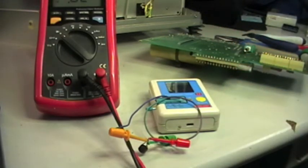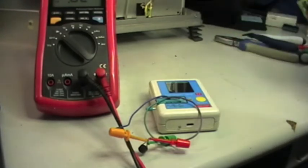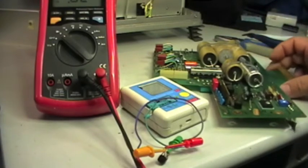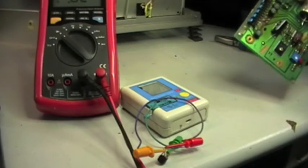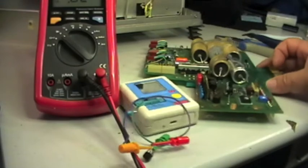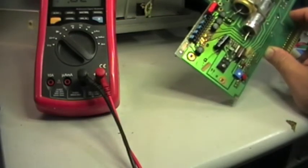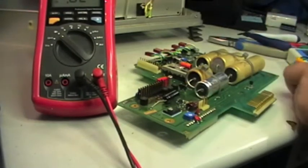Well, at this stage I wonder why, if it has been a short circuit that has been repaired in the past, since I was seeing this burned trace, or if the problem are the capacitors. Well, this is very strange. Two bridge rectifiers faulty in the same board, it's a rare condition. So I wonder if for troubleshooting somebody has made some short circuit or some unexpected contact on the board and damaged the bridge rectifiers, because the capacitors are not really bad.